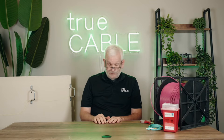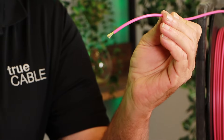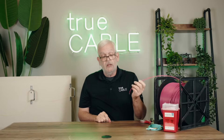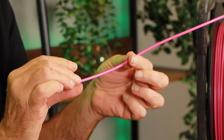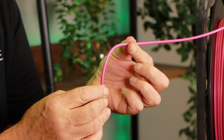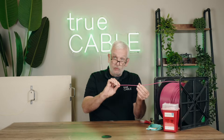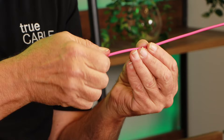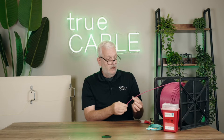Do not crush, step on, or drive over your cable. You need to protect the cable from radial — or lateral — forces coming in from the side, as they can crush the cable. You also need to protect the cable from bending forces. There is a minimum bend radius for each cable, and if you bend it too tightly, there will be signal loss. Don't twist your cable either. Fiber is not malleable like a metal core. When you twist a copper cable it just twists, but when you twist a fiber cable, it breaks inside.